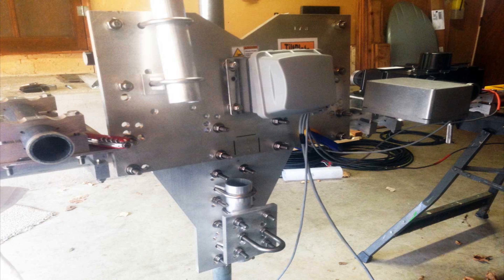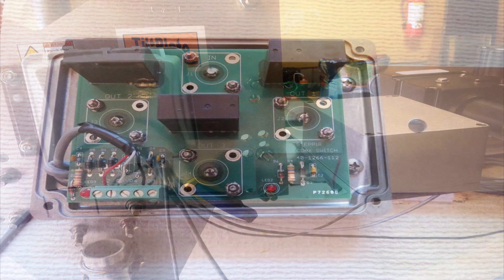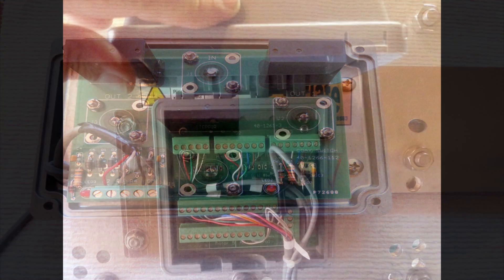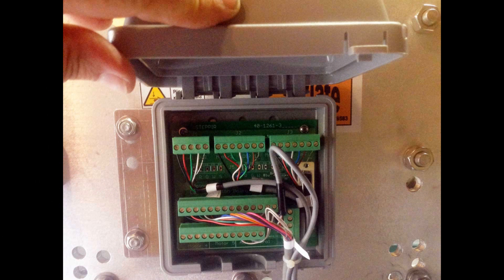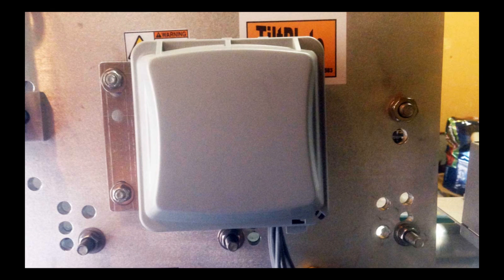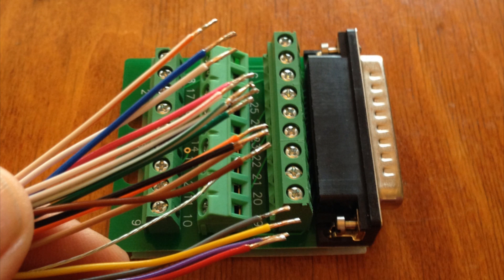The next task is to mount the coaxial switch and the junction box. The coaxial switch mounts to the boom, and the junction box, when using the tilt plate, mounts to the boom side of the plate. The control cable for the coaxial switch is then routed to the junction box along with the three control cables for the EHUs and the main control cable coming from the shack. The next step is to prepare the other end of the main control cable and connect it to the D-sub field splice. At this point we are ready for electrical testing.